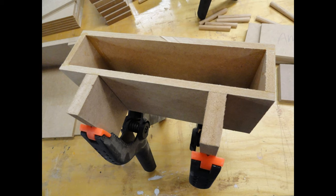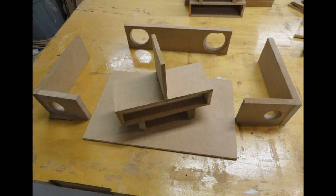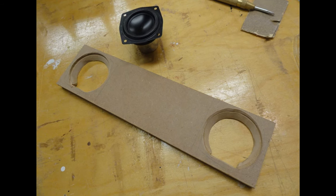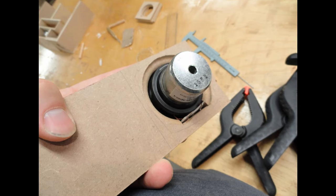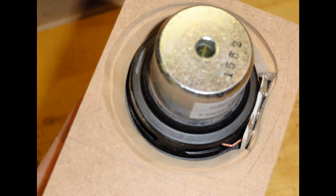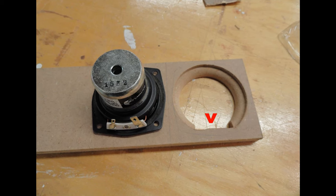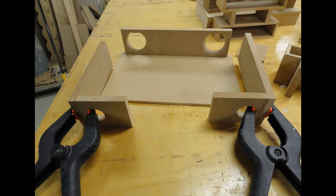After all the pieces were cut, I glued up this center divider as one assembly. It's all 1/4 inch MDF, except for the two short pieces that are 1½ inch thick. I'll explain that in a moment. I should also mention that you want to cut out the openings on the front panel for the two ND65 drivers before assembly. That way you can make some room for the drivers to breathe behind the board they're mounted to. It looks like I used a round-over bit for that process, but a few minutes with the Dremel tool would work fine too. Also notice the flat parts there for clearance for the driver terminals.